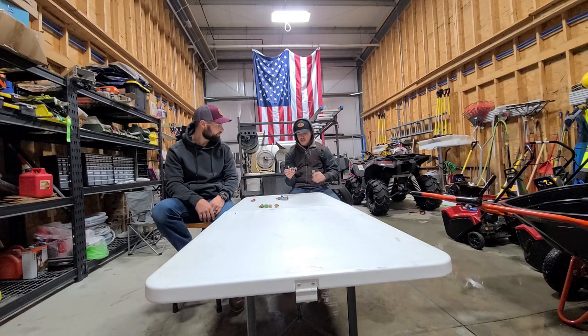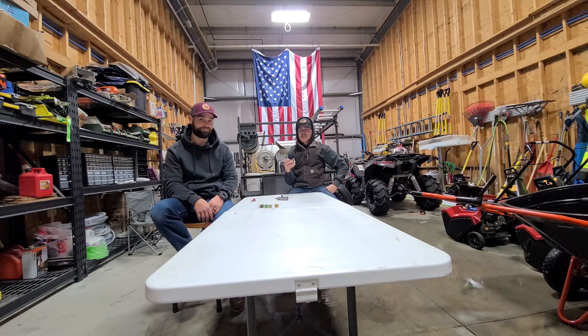There's 4 of them. We have a low pressure one that we usually use for washing houses. We have a medium pressure one, which is usually used for like composite, concrete, depending on how dirty it is. We have a second story tip, which is more of a stream tip. That'll help us get up higher on the homes without having to use pressure and get on a ladder. Then we have a sniper shooter tip. We haven't figured out the proper name for it yet, but it's a little bit stronger of a stream tip. If we get a third story home or even just a taller building in general, it helps us get that extra little reach. Or if we have to kill a wasp nest, these are great.